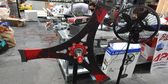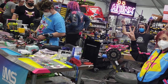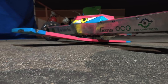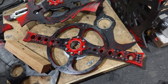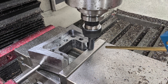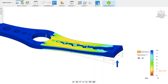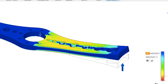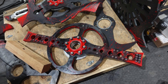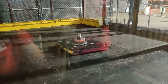For Season 6, we switched to the more crack-resistant AR500 steel for all our other blades, but the thick bar had pocketing geometry that can't be easily replicated with AR500 unless you're a crazy person. A solid AR key would have helped with this, but we were concerned that a solid AR500 bar would bend or the teeth would be carved away. So we made the club sandwich — an experimental bar with AR500 bread, an aluminum center, and S7 impactors on the ends that also acted as alignment blocks to prevent any shear loads on the bolts. This made for an even thicker bar with harder teeth, and in theory all the strength would be concentrated at the top and bottom where all the bending stresses are. It was designed more with bots like Endgame and Lockjaw in mind, and when we fought Minotaur, it came down to the sandwich or the key. The final nail in the key's coffin was an issue with the center bore that caused it to go off-kilter in spin-up tests, so we went with the sandwich instead.